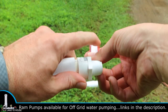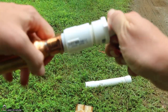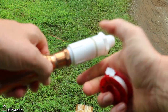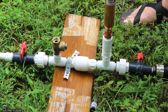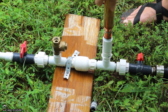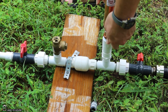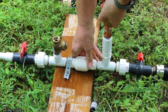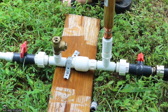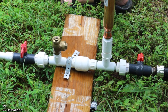In case you did not know, I have four different sizes of ram pump available at landahouse.com, Amazon, and eBay — links in the description. It is worth noting that the ram pump will work without a pressure tank altogether, but the water hammer is very strong and shakes things up and will likely break the pump apart after a while. The pressure tank smooths out that water hammer, so we're going to see if adding this arrestor does the same thing.